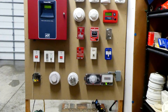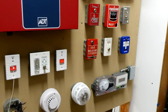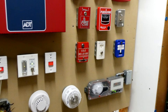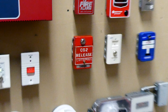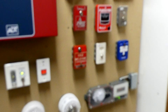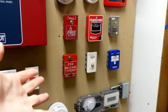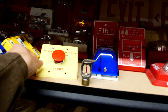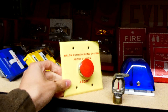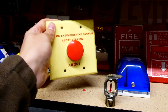That leads to one of the downsides of a CO2 fire suppression system: if someone is trapped in that concealed environment where the fire is and the CO2 system releases, that person is going to be suffocated as well. That's why these systems have many safety features, such as requiring more than one device to activate — like a smoke detector and a CO2 release pull station — in order for the agent to go through the discharge nozzle. There are also abort switches; if you push this down and hold it, it will keep the system from going off. This one's for a halon system.